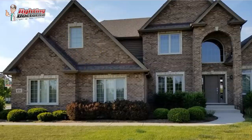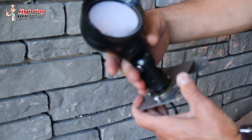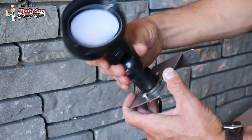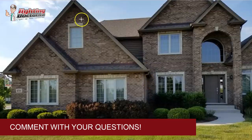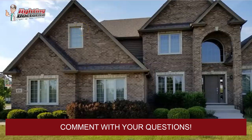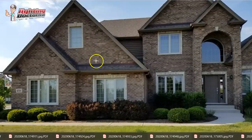And then the next thing I would do if you really want to elevate the design, I would work on trying to get a light on this top peak here. I think that would look really good. It's actually pretty easy to do — we have these gutter mounts that you can actually just fit right in your gutter and mount that light right in there. You could actually get that on this second story. You can just make your connection down on the ground and then run your wire up the downspout, either just behind it or right inside of it, across the gutter, put your bracket in and then mount that light so it catches the second story peak. That's something a lot of lighting installers won't go to the effort to do, but it really makes everything stand out. And that would just be with one of those standard up lights.